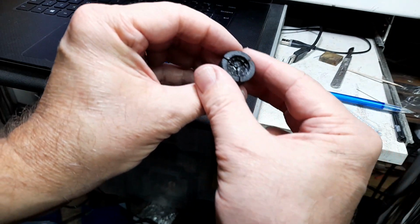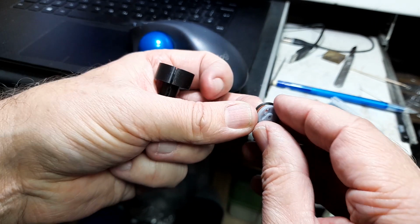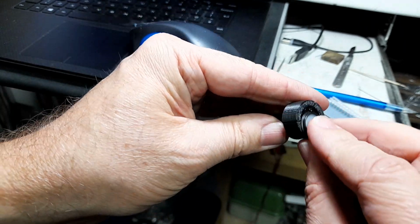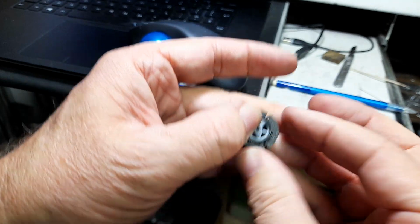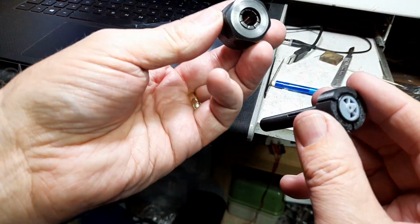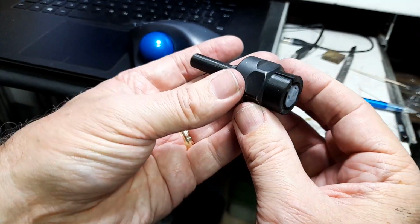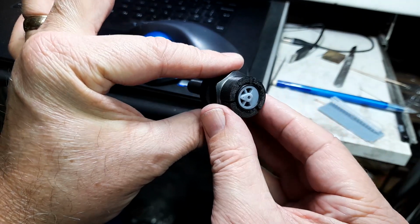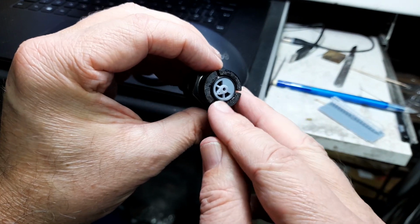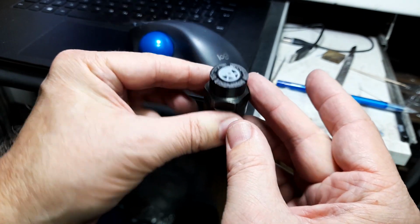I've not actually used it in anger yet, but you can see it's basically a collet. And the wheel, let me reassemble that again. Oops, daisy. The wheel will sit in there like that, and I have my lathe collet, that's a 10mm lathe collet, and that will go all the way in there, and I tighten up the lathe collet, and that will clamp this printed collet up tight without damaging the wheel, and I can then face things off and bore that cleanly and accurately. That's the principle.